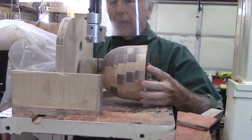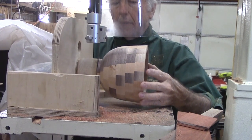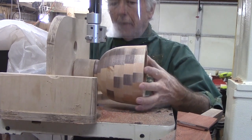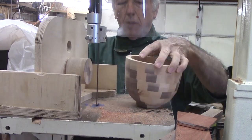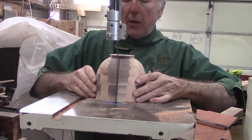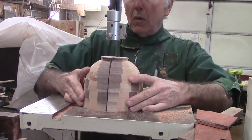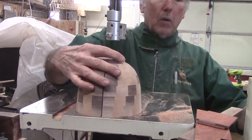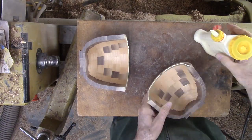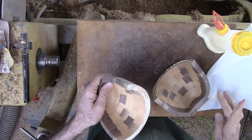With this bowl, I did not want to risk parting off at the lathe. Instead, I mounted the bowl to my bandsaw jig, which ensures a safe vertical cut. Time for the money cut. After carefully aligning to the joint between the two adjacent walnut segments, I can make the cut while keeping track of the blade and the joint. Fortunately, the top is flat and rides nicely on the bandsaw table. Time to glue the two halves together to make the oval bowl. Since the joint is side grain just like the rest of the ring joints, the joint will be strong.